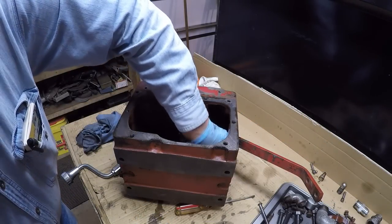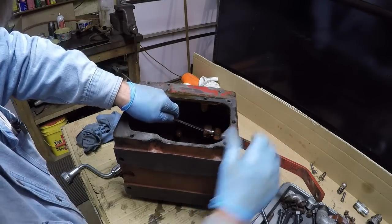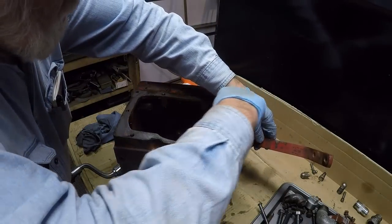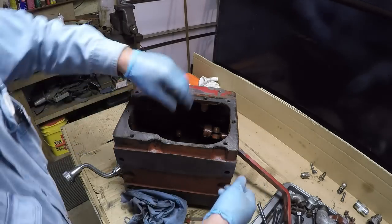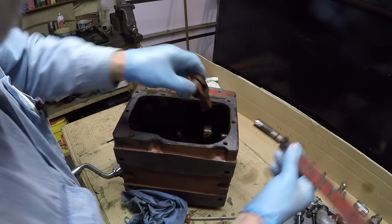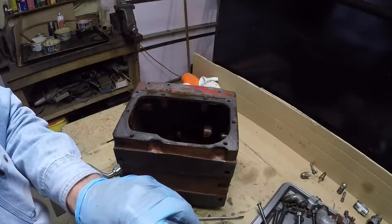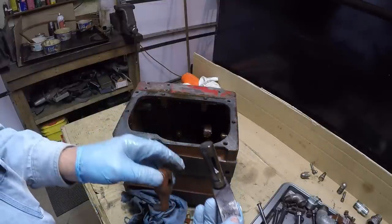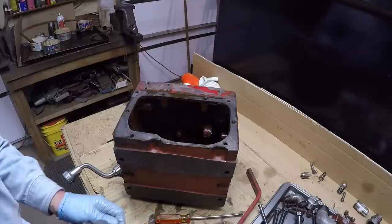Got the clamp bolt loose and we'll finish getting that out of there. Next up, there's a key in there — let's see if we can get that fished out of there. There we go — right in the bottom with the oil. What they call the key is actually a thick washer that the clamp bolt goes through. So this should pull right apart now. Just like that — and all they have for a seal is an O-ring. That'll be a very easy fix. I'll double check, make sure this weld is good. Put a new O-ring on here. Clean everything up. Got a bunch of residual oil down there, so we'll get that draining overnight. Tomorrow we get into cleaning this thing up and getting her back together.